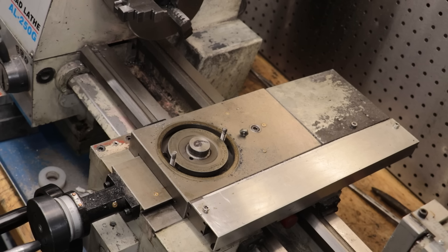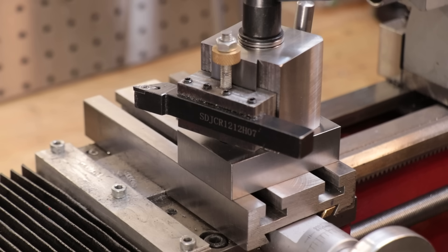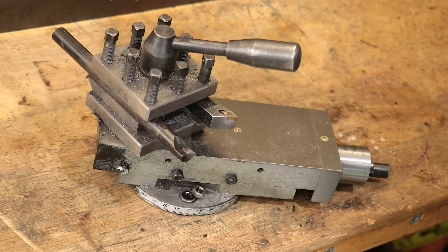Even still it was causing me a lot of issues and it needed to be replaced. Rebuilding the compound to fit the new cross slide is not out of the question, but I'm going to ditch it in favor of a new solid compound, very similar to what I had on the old lathe. Essentially I'll be making a solid riser block for the tool post, which is going to be a lot more rigid. The only real downside is that you can't cut tapers, but considering how little I use the compound and that I can always cut tapers using other methods, I stand to gain more than I lose.